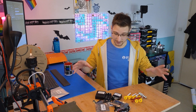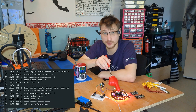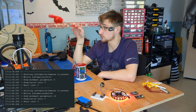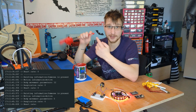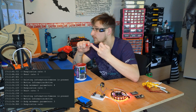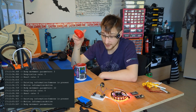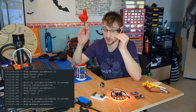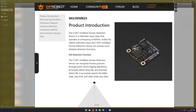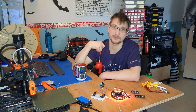Now that I have all the parts, I can start putting everything together. I've been working on this for like two days now. I've got the speaker to work just fine, I've got the lights to work just fine. But for whatever reason, this millimeter wave sensor just does not want to tell me what I want it to tell me. I've got the default script loaded up and the only thing I'm getting from it is that a person is there and that I am an active person, and my body movement parameters are anywhere from 2 to 90 — I still have no idea what that means. My respiratory rate and heart rate are just nonexistent. I figured out the code on the wiki site for this little guy on the DFRobot website has a typo in it — it should be an E and there's an I. It's very annoying, DFRobot — fix your crap.